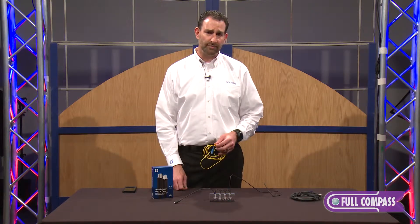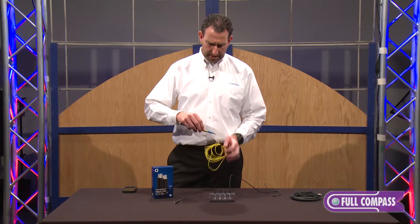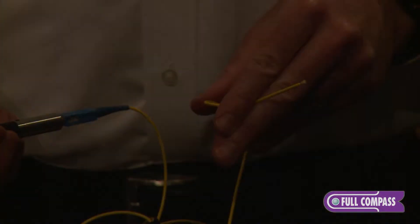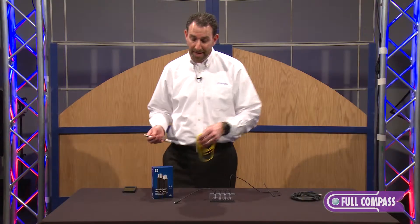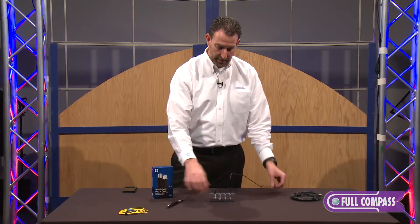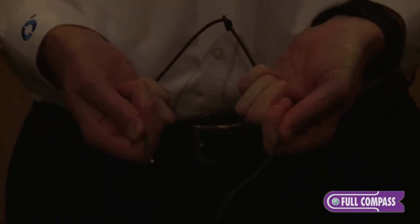Most people, when they think of optical fiber, think of it as being very fragile. This is a typical optical fiber with an SC connector on the end — signal goes through, but I certainly wouldn't bend this fiber because if I did, I'd cause some attenuation. Corning developed a bend-insensitive, zero bend radius fiber. If you look at my little bendy demo here, we do lots of bends, tie it in knots, and I still get a great optical signal going through this cable.